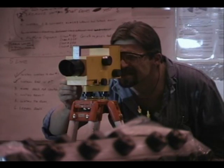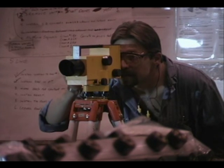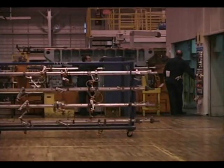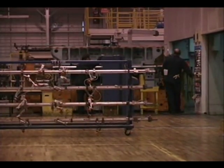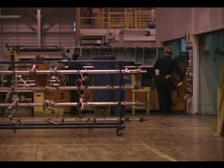The applications work very well, and the leveling for the rolling bolsters to roll out properly with these heavy dies, and the leveling of the bolster rails are very close in tolerance. They have to be within a half thousandths per foot. We have yet to find over the past 10 years that we've had to go back and do anything with bolster rails or rework in a bolster rail steel because of any misalignment.